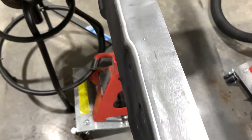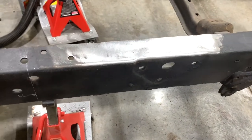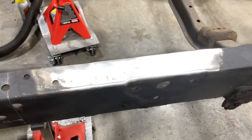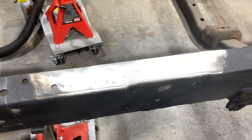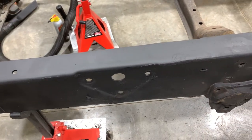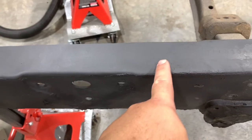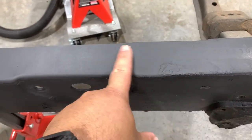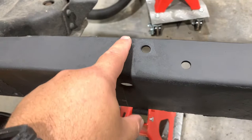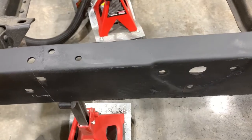I am pretty happy with that — it's like it never was. I'm going to shoot a little bit of black paint down just to keep it from rusting. It's not going to be a permanent paint job, but it'll keep the rust from forming because it will form pretty fast on this mild steel. The paint is dry and you can't really see where it was, which is pretty much the goal. You can see where we started grinding away paint and grime — it's smooth here and rough and textured over there. That's pretty good in my book.